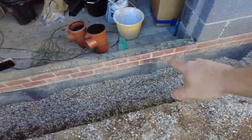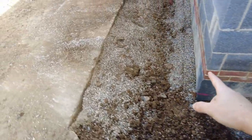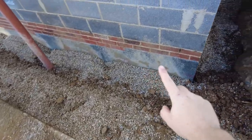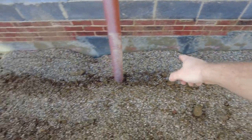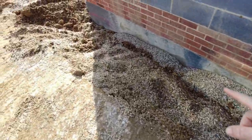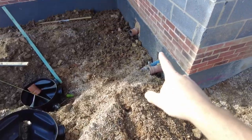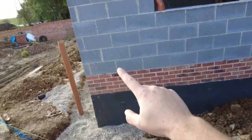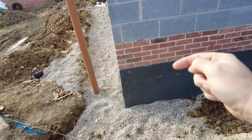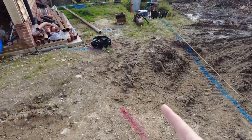I'm just going to go through here on top of this, kick it round there. I will have another gully here, so that one's going to be roddable. This one will be roddable. I'll go down here. I'm just going to follow this all the way around. I'll go over the top of them, round that corner. I'm going to have another gully here that drops into it, and then I've got to drop it low to come all the way across to here.